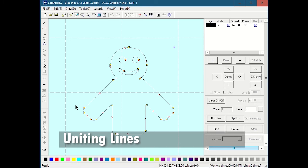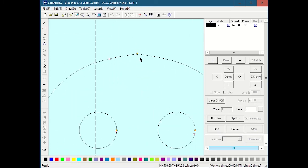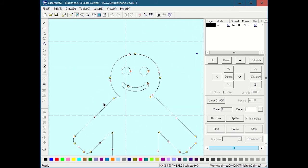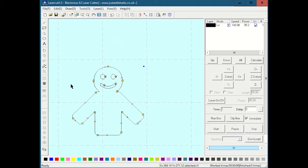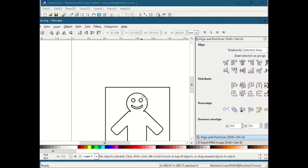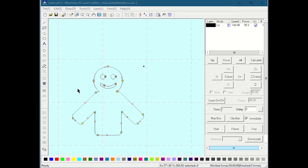Step two is, if you'll notice, I'll zoom in a little bit, we have all these little yellow dots and these little red arrows, and these represent the different pieces of geometry in the DXF file. And in this case, even though the way we saw it in Inkscape over here is we saw these things as giant single geometries, when we exported as DXF, it saw each of these as individual pieces. And the way that it's going to cut these, it's going to cut them as individual pieces, and you don't even necessarily know what the order is.